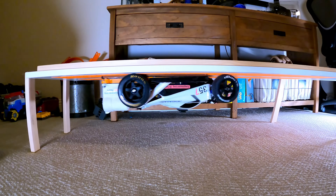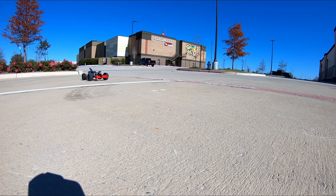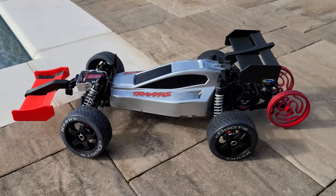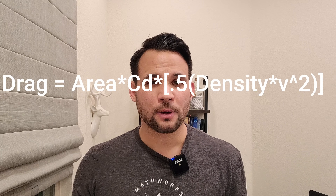Finally we are able to drive, stop, and resume driving again without the risk of falling. But why would anyone go through this much trouble when they could just add huge wings on the car, like on modern-day F1 cars? The main reason I took this approach is because it gives me tons of downforce at very low speeds — actually zero — which I really want because I want a car that has tons of lateral acceleration right off the line. The second reason is aerodynamic drag. If I wanted the same amount of downforce with a conventional wing, I would basically have to double my frontal area, which would effectively double my drag, and would probably also make my drag coefficient worse.